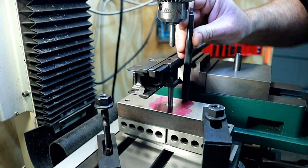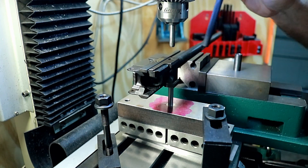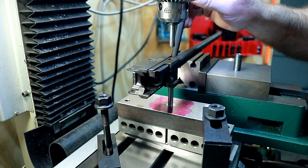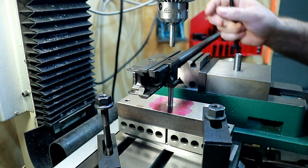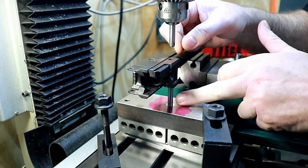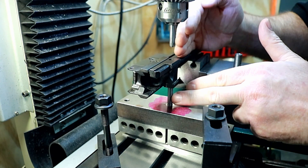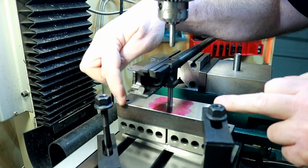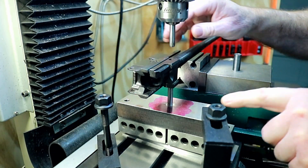But what if your barrel pin is out this way? That's exaggerated, but what if it's out that way? That's why you need to keep this loose. Once I get all this bottom part in line with the V-Block, make sure I'm butted up back there, I get this all in a line. Once I'm happy with it being in a line, I can snug this down, tighten it up on both sides. I don't want to tighten one side and have it kick on me.